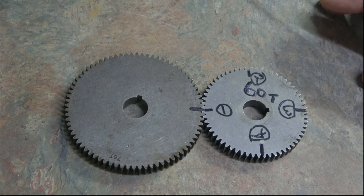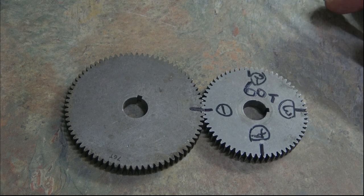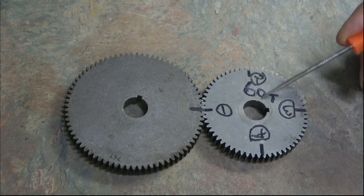The idea is that you set your lathe up for conventional screw cutting. Set your compound to 29.5 or 30 degrees. And what you have to bear in mind is that when you're taking your depths of cut, you don't take the depth of cut for a 4 TPI thread, it's for a 16 TPI thread, and the reason is you're cutting 4 threads per inch and 4 starts, so 4 fours is 16.